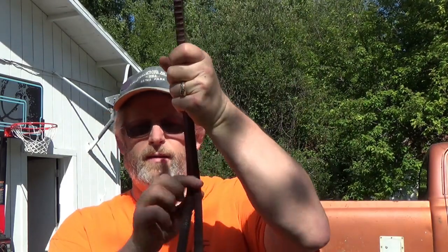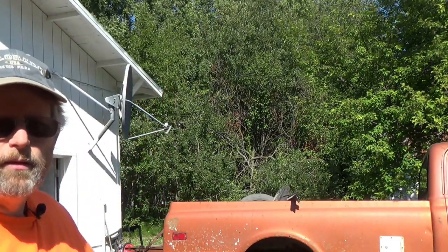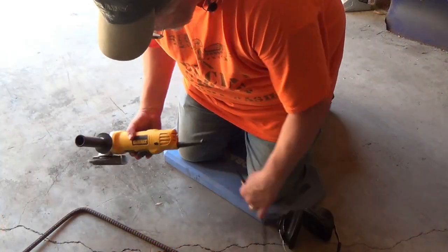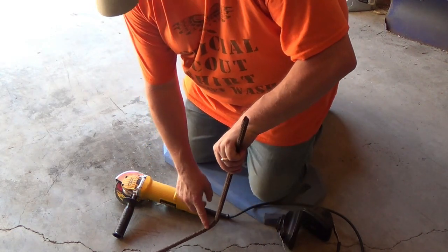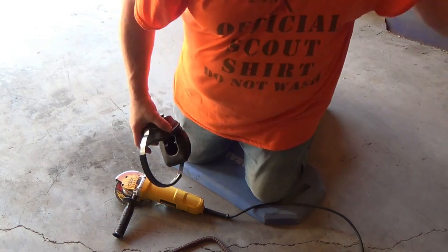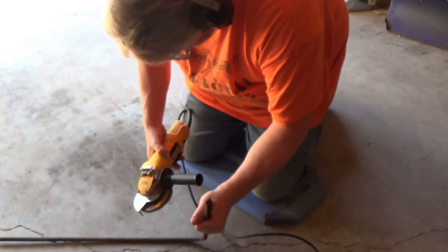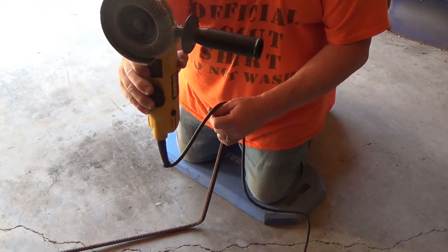The first step I need to do is clean the area where I'll be welding. I'm going to get a grinder and clean this area right here on both of them. I've got a little stand set up over here for me to weld it together with. I'm going to take the grinder and just get down to bare metal in these joints here. I've just got a regular old flapper disc sandpaper on here.